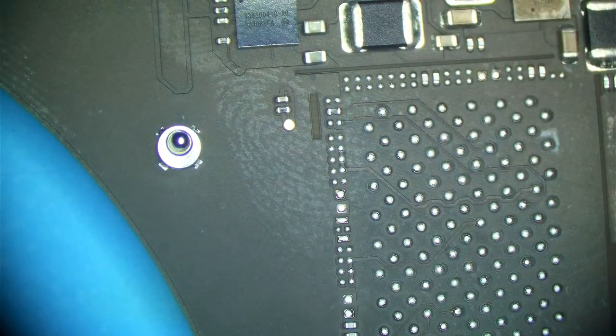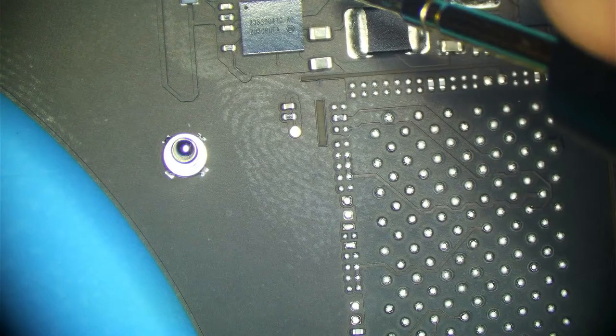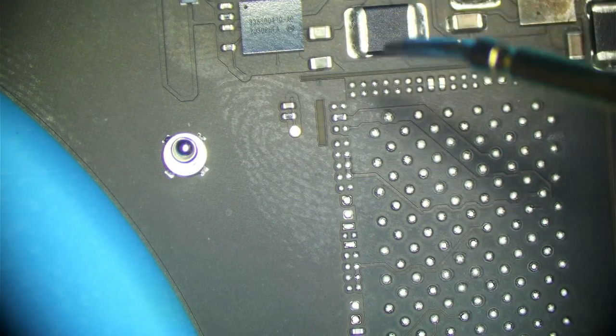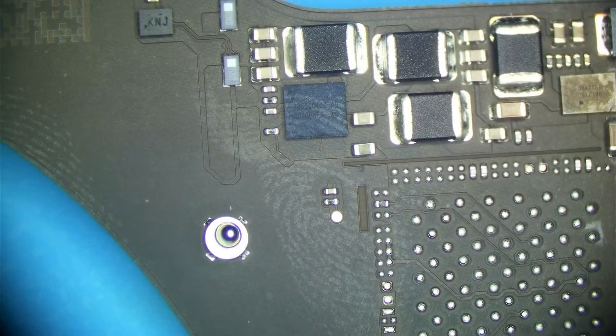I can't tell what it is, so I'm going to get out the thermal. It's probably the 2V5 NAND regulator, but let's see what PP bus is. PP bus G3 hot is measuring 12.63 volts, so that's good. Bridge OS is trying to boot. 2V5 NAND, I'm going to guess it's low. Yep, 0.04, 0.9, 0.7. All right, so I have hope for the NAND, but I need to figure out what's actually getting hot. So I'm going to unplug this before I kill anything.